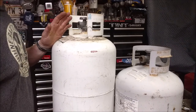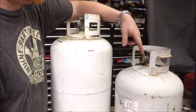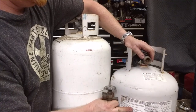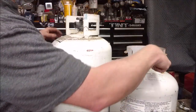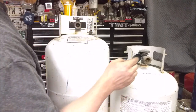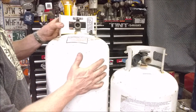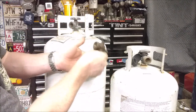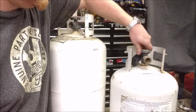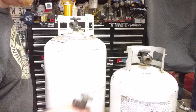There are basically two different types of propane tank valves you're going to run into. The old style is the POL — stands for Prestolite. The newer style is the QCC1 or OPD, overflow protection device. With the new style, you connect the coupler on the outside and thread it on regularly. The old style you screwed the fitting in and it's reverse-threaded. A lot of people don't know the new style actually still has a reverse-thread coupling. I prefer to use the old POL style because it flows better and you can empty the propane tank easier. The OPD style — if I open it up, no propane actually comes out. The POL style, I can open it at any point and air comes out. That's one of the safety features they upgraded with the newer style.